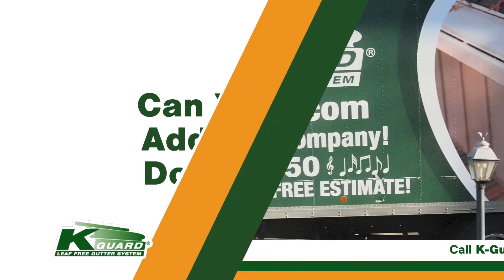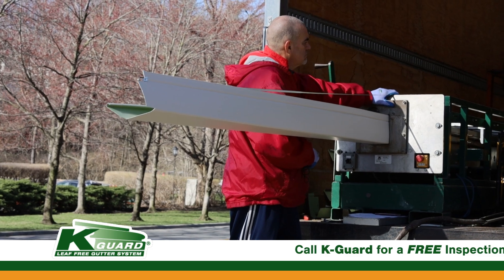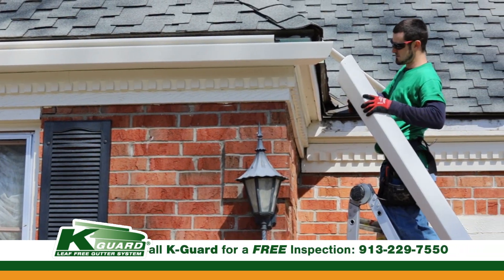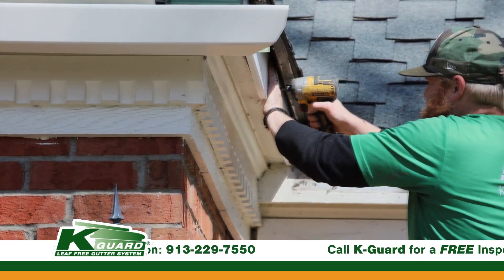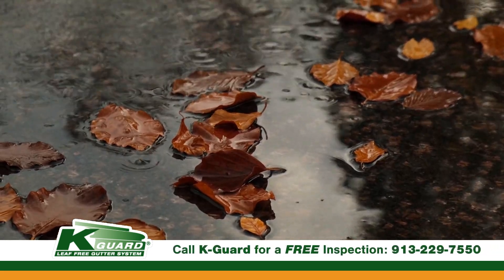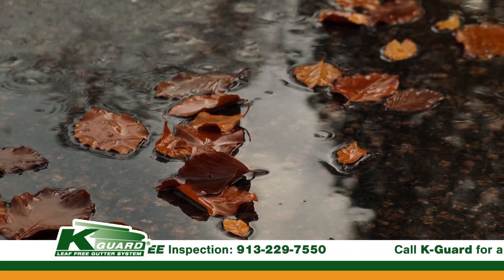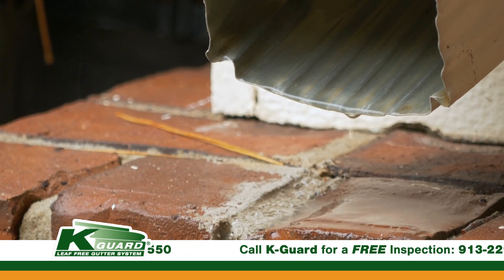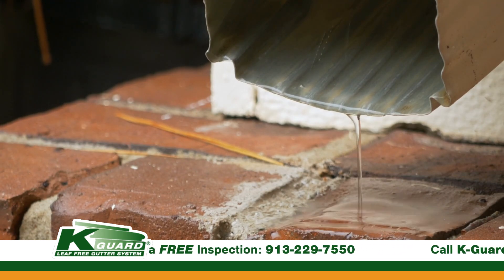There are lots of reasons that go into this. What size are your current gutter systems? Do you have a 4, 5, or 6-inch? Do you have a shallow or a deep troughed gutter system? Are you having issues with water pooling in a particular area? Do you have 2x3 downspouts on your home now, or do you have the oversized 4x3 downspouts? Did you just recently do new landscaping or have some water issues with the way the landscaping lays and it doesn't direct water away from your home? Is it possible to change the direction of a current downspout? There are lots of different factors that determine whether or not you need to add a downspout to your current or a new gutter system.